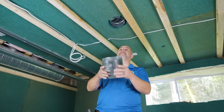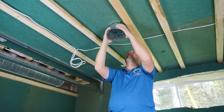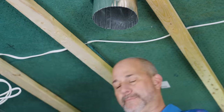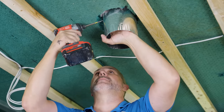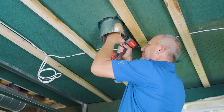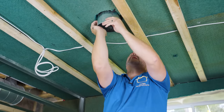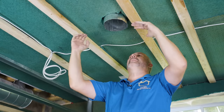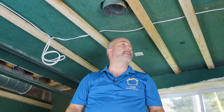Now I've got a little six-inch extension. I'm calculating the extension length from the green board plus my framing plus 5/8 drywall plus the compression factor. Now that's a nice piece of ductwork. When I go and install my drywall, it'll be sitting on the duct with resistance, which is perfect. Then I come back with my Roto-Zip tool, find the edge, and zip it. Problem solved there. We also have a problem in the corner dealing with the plumbing, so let's go tackle that.